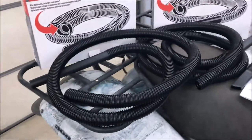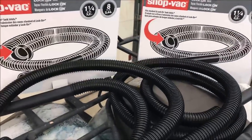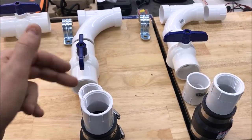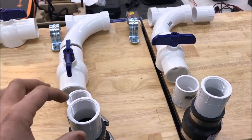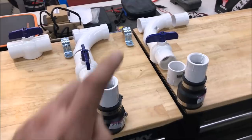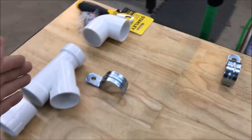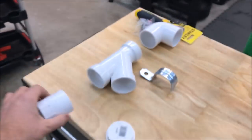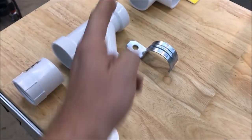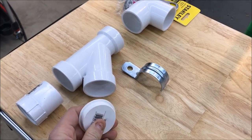These rubber boots will thread into some hose. Since I didn't want to chop up the hose, my system has a bit more cost — these were $20 a piece in 2017. I got one I could cut up to make short extensions so the grinder connection is flexible rather than rigidly mounted. I'll silicone those up for a tight seal and solvent-weld the PVC pieces together. I'll cut inch-and-a-half pipe to size as I go, using an elbow to change directions. I was concerned about bigger chunks getting caught in the long run, so I wanted to make a cleanout — a stub piece with a cap that has a good snug fit.